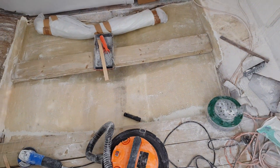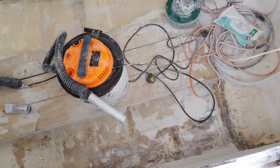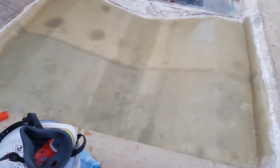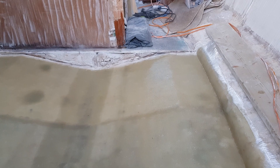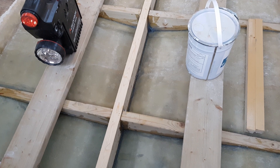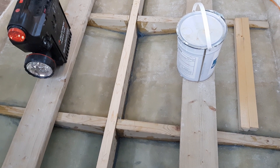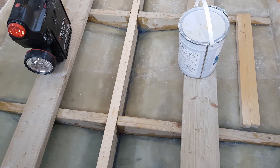More grinding inside — so now I've just got under the wood and down there to do. And I've finally got a layer of structured glass down, which I'm so pleased about, I can't even begin to tell you. You can just about see in the light there — you can see the weave of the glass that's gone down. Here we have bulkheads and a centerline stringer finally resined in. I'm sure it will need some retouching and finessing and adjusting and all sorts, but by God we've made it at last.